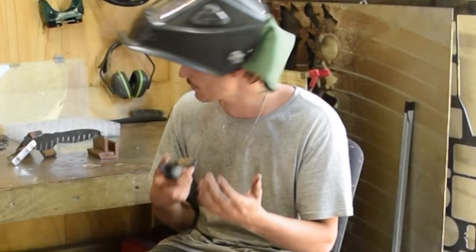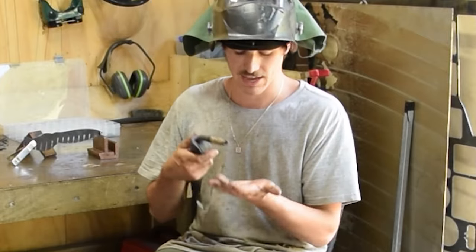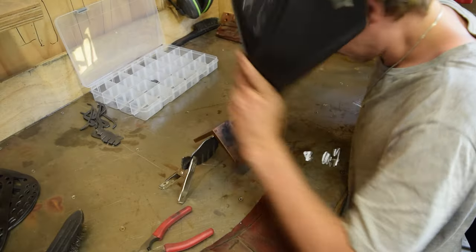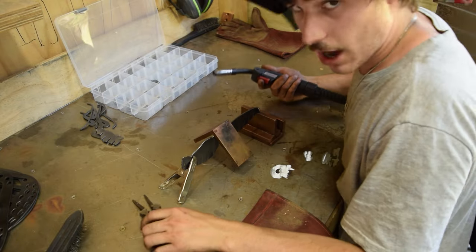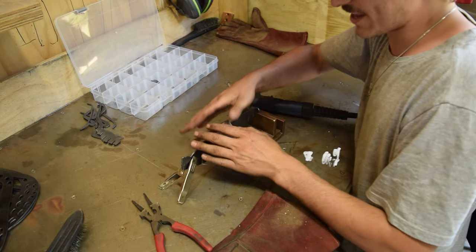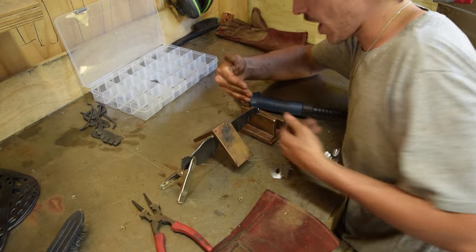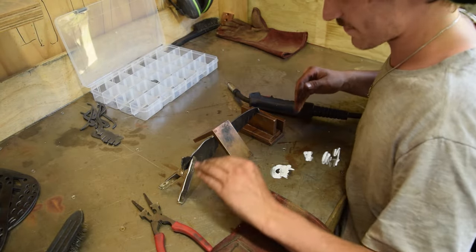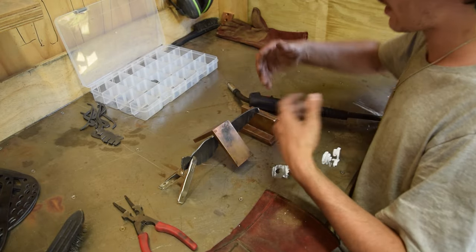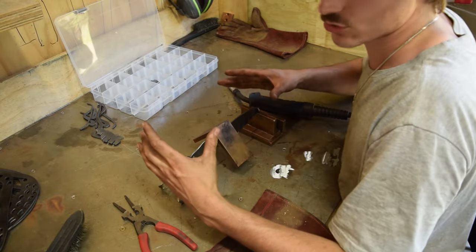Put some gloves on — you're going to be picking this up and manipulating it while you work, just to make sure everything's square. If you don't wear gloves you'll end up with crisscross burns on your hands. Before we weld, I've got a copper brick holding the part and a copper weight pulling down the spine to keep it in place. I like to square it up by height, but inevitably when you weld it will warp, so you'll need to come back with pliers to make sure everything's even for the nicest contour.